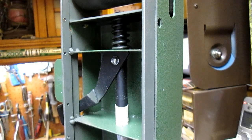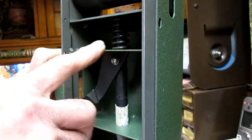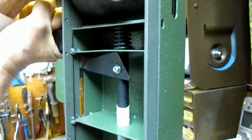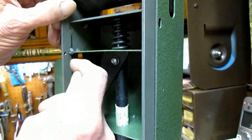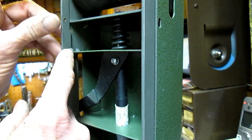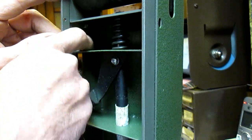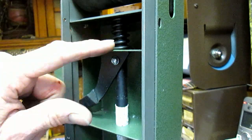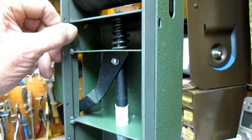And a little backtracking. I don't know if it's going to show, but this piece of metal is flexing when you tension the belt. The spot welds were pretty cold because I didn't want to burn the paint, but it didn't stick to the flat bar. This may be an issue. It's going to work the spot welds loose from the case. I'm going to weld a little piece of flat bar across to stiffen this, grind all these out, and spot weld the flat bar in.